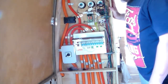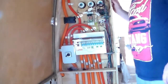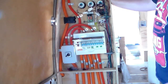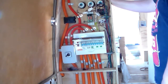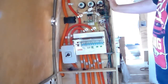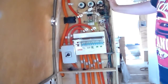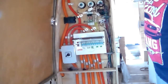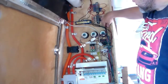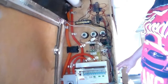Other things I'll talk about with regards to wiring that I had to find out. Now this actually threw me. On the bus, I've got the original factory 24 volt system that starts the bus and runs the bus electrics. I've got 12 volt items such as my lighting. You can't see that, there's a light above here. Lighting and the exhaust fan and everything in the bathroom. And what else is 12 volt? Oh, the igniter on the stove, which I haven't wired up yet, that's 12 volts. So all this stuff here, I don't know if you can see that. I've got a couple of rows of 12 volt circuit breakers here. So this is all 12 volt stuff, all this cabling down here. And then obviously I've got the 240 volt AC stuff.